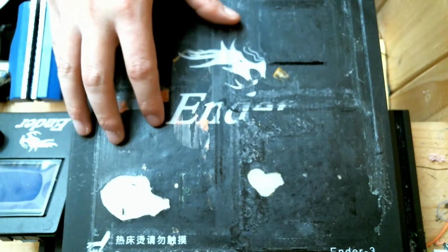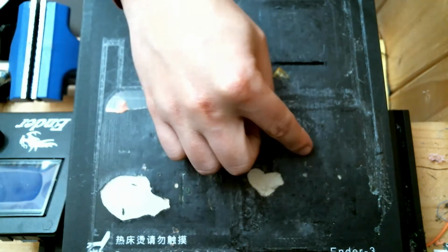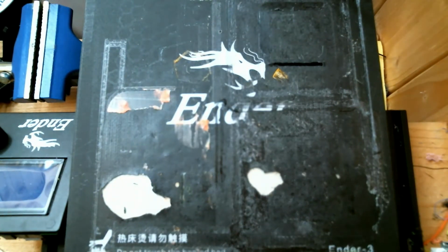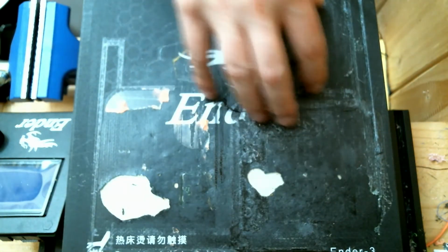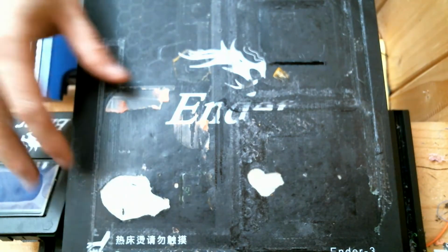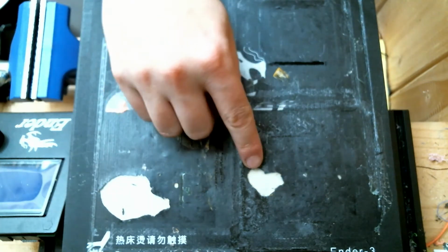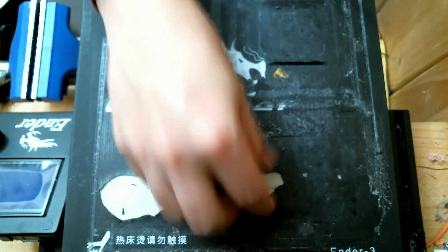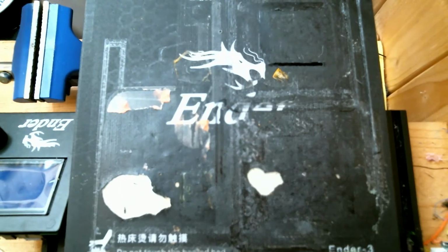And one of the things I do to maximize my usage out of a board is I usually only print on a single corner. So if I'm doing small prints, I print on one quadrant or the other. That allows me to use this board even when you start seeing damage, when you literally tear up the coating they put on it, so the PLA or whatever sticks better. I had some damage here. I can still print over these areas, but every time you do that, you'll pull up a little more and more. But back to the print.